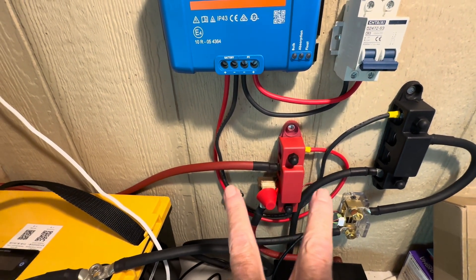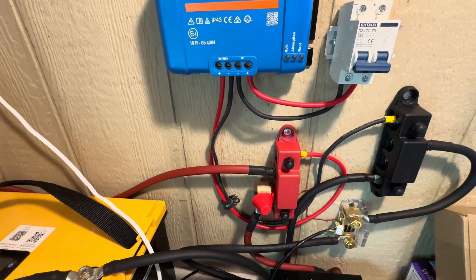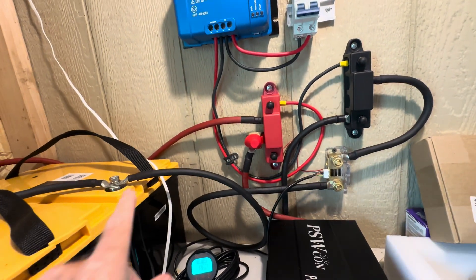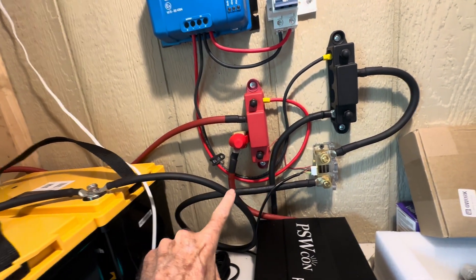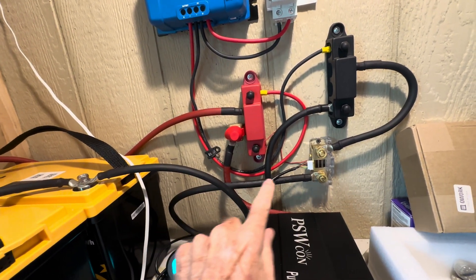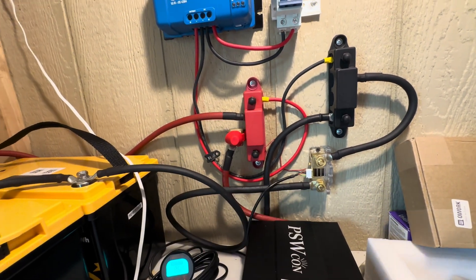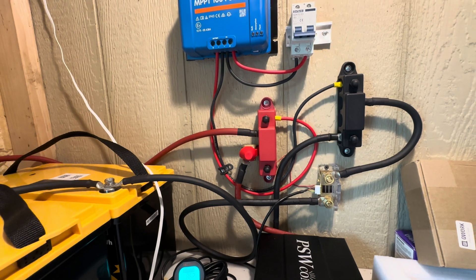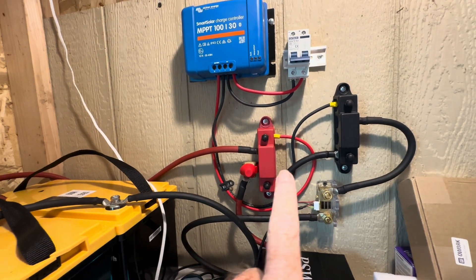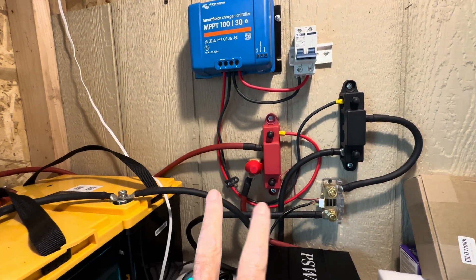I'm going to turn this into what I'll call a blue corner because I'm going to tie up some more Victron products here. But until those arrive, I need the power up here to be working. So I'm leaving my lengths longer and moving them around in a way I wouldn't normally — I would normally cut these shorter for nice, clean, short runs. But because I'm not exactly sure how the rest of my components will tie up, I'm keeping the extra wire in case this starts to spread out a little bit more.